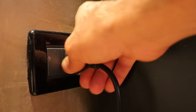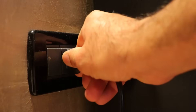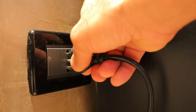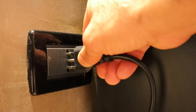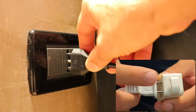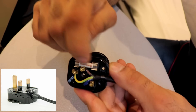Let's see what the actual Italian plug looks like. The ground is in the middle and live and neutral on the sides, and you can plug it either way. Still better than the North American plugs, because it has about a centimeter of plastic here, which means when you insert it, there's no chance to get shocked — it has to go further in before it connects to live and neutral. In the North American one, if you plug it halfway in, you can accidentally touch the live wire. But this one you can't. Still not as good as the United Kingdom plugs, as they have a fuse in every plug.